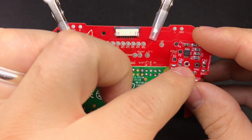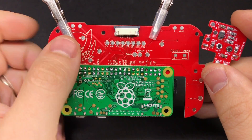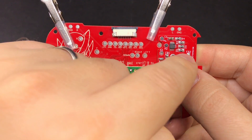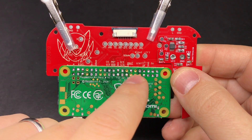The battery monitor board has these two pinholes which line up with the two power input pads on the bottom of the button PCB. What we're going to do is attach it by flowing some solder down into both of those pinholes to attach it to the pads below it, sort of like we did with the Raspberry Pi.